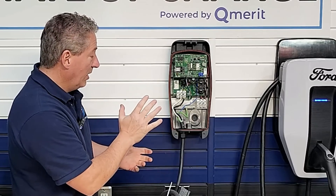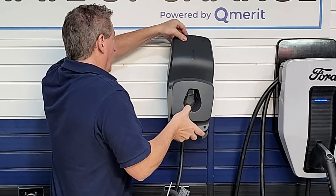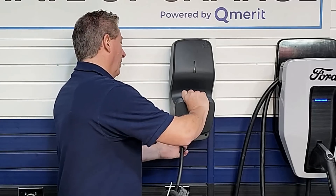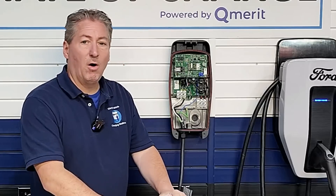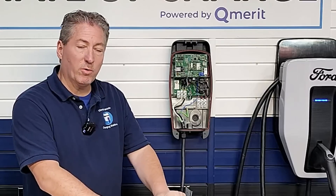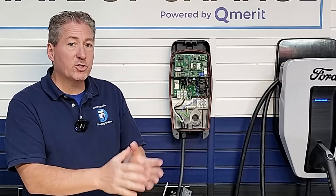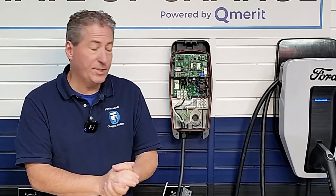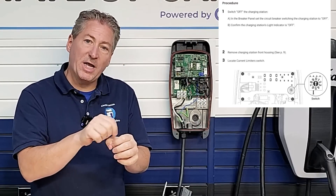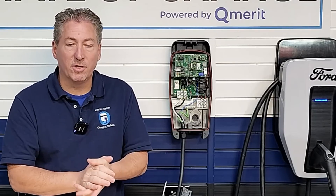The units are power adjustable and can deliver up to 30 amps, but you can dial it all the way down to 6 amps. With the X5 smart charger, you do that in the app after completing installation. But if this were the G5, the instructions show how to derate the power using a little circular dip switch inside the unit where you set the amperage you want to output. It's all in the instructions — it tells you where to set the dial to deliver the power you want.